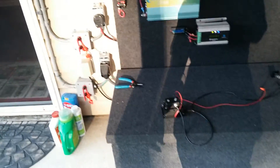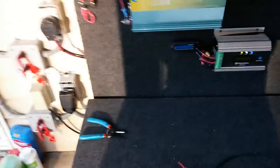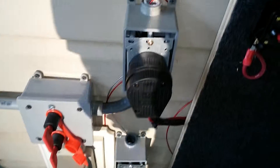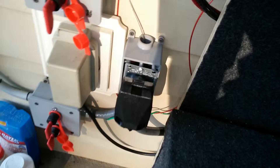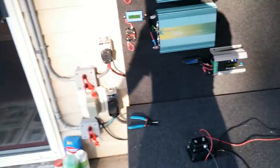So that's my whole grid tie system here, and that's my battery box on it here. Everything is done on wheels — the box is on wheels, the rack is bolted to the box, and everything is pluggable. This is a 240-volt plug I'm using here, so I could plug everything off if I want, including the ground cable — the green wire can be plugged off.